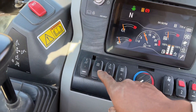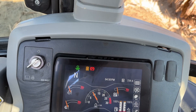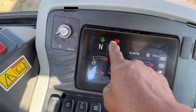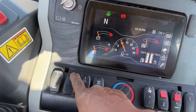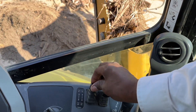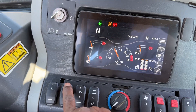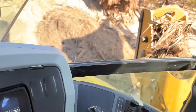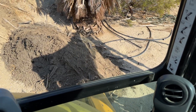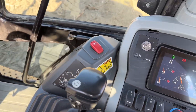This button right here — see this little thing? Apparently it's a hydraulic cylinder with a lock on it. To unlock it, push this button. See how that light went off? Now I'll try to lower that little arm — see how there's nothing happening? But after I come over here and unlock this, oil is flowing to that stabilizer and it moves. In fact, the whole backhoe — nothing works if that thing is locked.